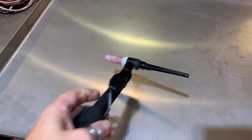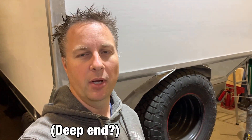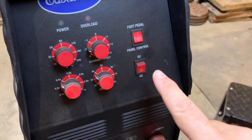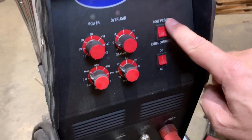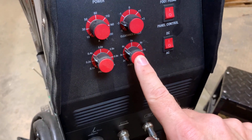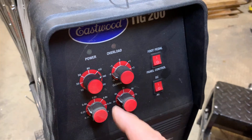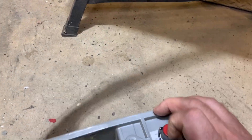Thought I had more gas than that — I guess we'll see how far we get. There are a couple things I need to do before jumping right into the shower pan. Firstly, last time I was welding aluminum; now I'm welding stainless, so we need to switch over to DC. I am going to stay with the foot pedal control. My pre and post flow are going to stay the same. For power, I don't need as much — probably 110 — but actually, because I'm using the foot pedal, I need to change that down here.